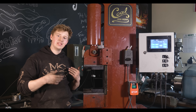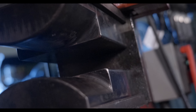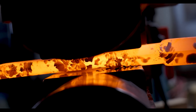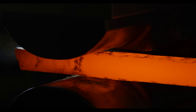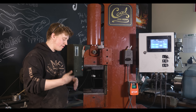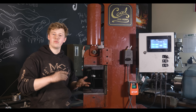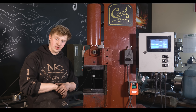I said I wanted five inches of flat die and three inches of round die. That is a really nice size because it gives you that full-width flat die — it allows you to keep bars really straight as you forge them out — and that combo die really helps you to draw stuff out in a very linear motion. You can either draw bars out lengthwise, or if you want to spread something out, you can do that, though there's only three inches of the round section.